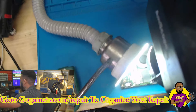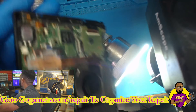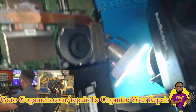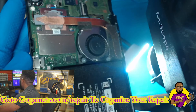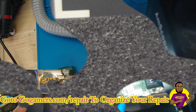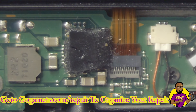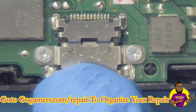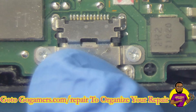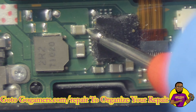We have a regular Nintendo Switch and I already have it open. I already tested the charge port — nothing is wrong with it, I checked the pins, everything is good. That means it's more than likely going to be one of the chips on this motherboard. Here is your HDMI IC, here's your USB-C, and here is your BQ chip. The BQ chip handles power management and works with the USB-C, so let's do some testing.